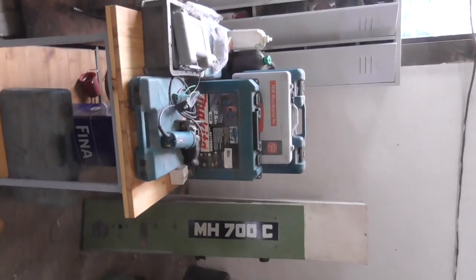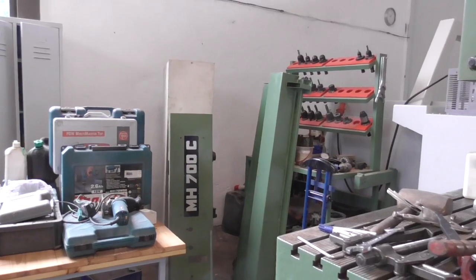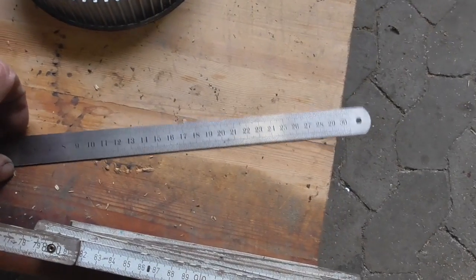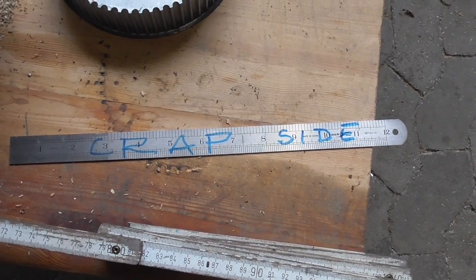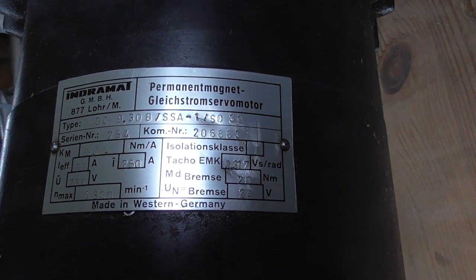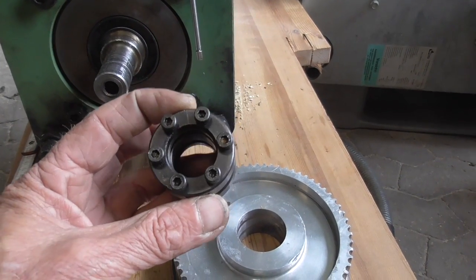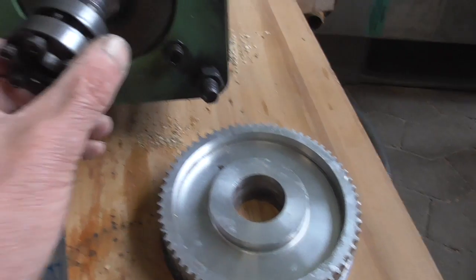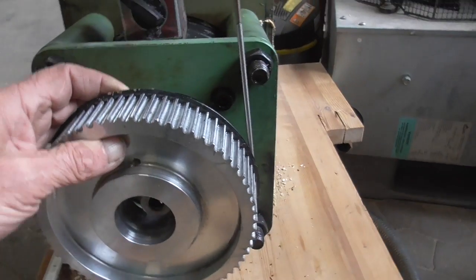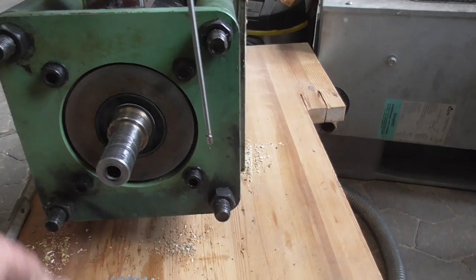Somehow, during storage or moving or whenever, someone tried to move it with a forklift. I do know that you can't move it with a forklift. What seemed to happen — and the result is a bent servo shaft. This is the servo. It's about 70 kilos heavy, about 80 centimeters long, and made out of pure unobtainium. I have to repair it. This is how the belt wheel is connected to the servo — it uses a coupling. This coupling can only be used one time and then has to be thrown away. By the marks that look very suspicious and are quite telling, you see that there was some brute force that tried to lift three and a half tons, and that had to go wrong.